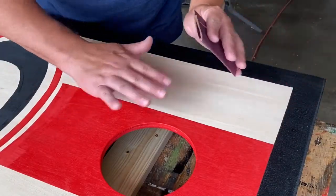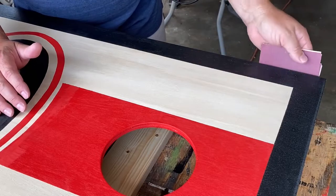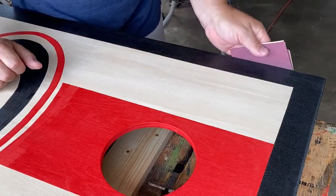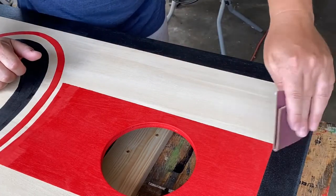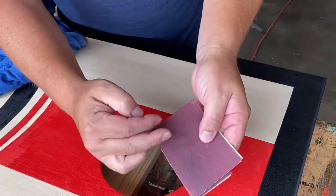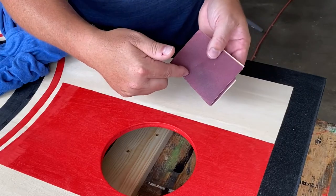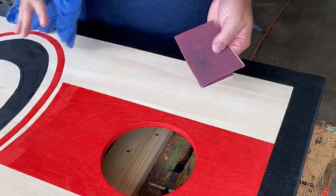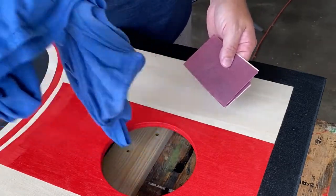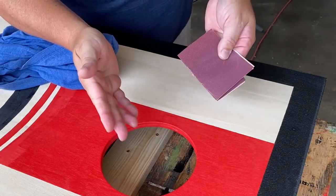The way I do this is I like to start out on my edges, and I'm just giving this a light touch. You don't really need to bear down on this — just a light touch is good. I go around the edges and wipe the dust off. You'll see there's a lot of dust and a lot of paint residue in the sandpaper, so we need to get that out. I'm just going to knock it out with my dust rag — an old t-shirt — and it cleans it out really well.